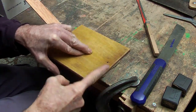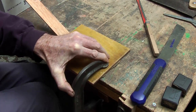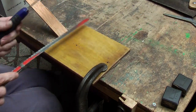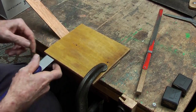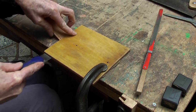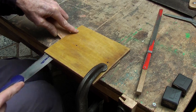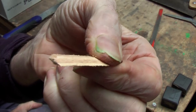And I am going to clamp it back about four or so inches until I think the tension is right, because I am going to be able to get a saw blade — either this Japanese pull saw or a hacksaw blade — put it between the two boards so that I can now cut a sliver like this.